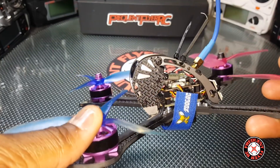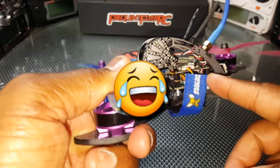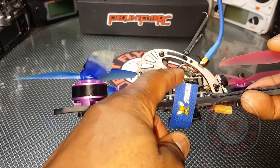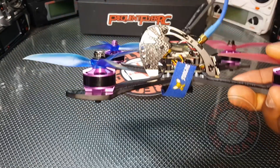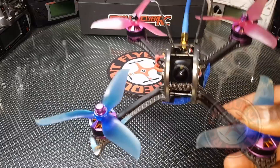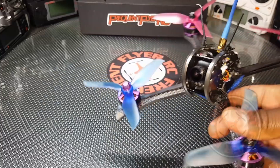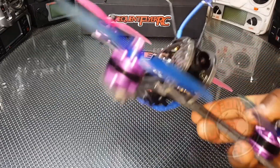I think it's called the Kakute — I know I'm massacring that name. The flight controller has a floating gyro on it, which is supposed to make this thing fly really smooth and stable, and mine does. But when things are touching on top of it — between the flight controller and the VTX — that causes problems. I've heard of people having strong drifts to one side, but I didn't have those problems. It looks like FuriousFPV has taken notice because they switched the flight controller. The specs on Gearbest now list a FuriousFPV FC, so no more HolyBro Kakute.